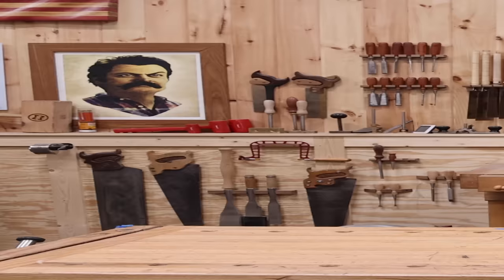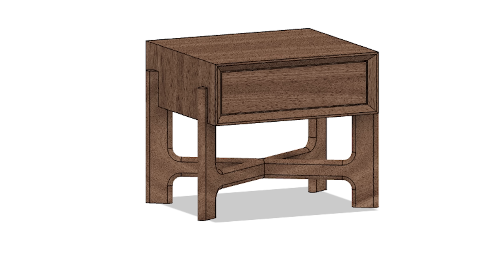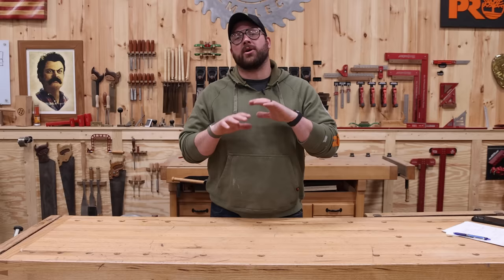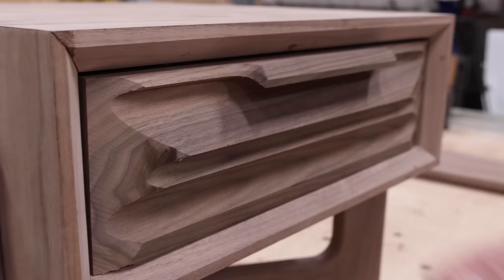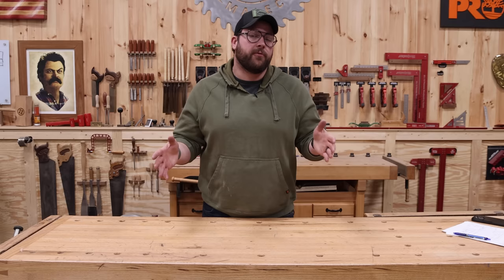My table is going to be completely built out of solid walnut. We're doing a custom base with a waterfall box for the top. The drawer box will have some hand-cut dovetails, and I'm going to try something completely new to me for the drawer front — an integral drawer pull out of solid wood. Walnut's expensive so this project is probably going to cost close to $750 or so, and I got it built in about four days total, which means you could probably get it done in two to three weekends.